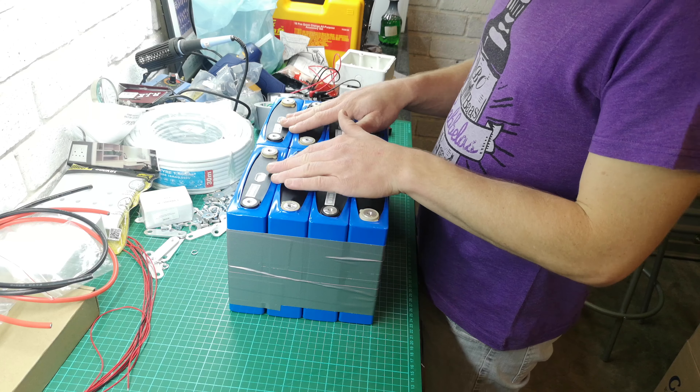I'm going to start connecting all my connectors. I've also got to connect up all these balance lines. If you look at your BMS, it actually counts from the bottom where this plug connects in - this is obviously your negative, that goes on to your first negative point. Then you've got to count the eight cells, and all these red lines go to the positive battery cells - first positive, second, three, four, five, six, seven, eight. These guys connect in line with your negative and then out to your supply. That's how you control the charge and manage the battery pack.